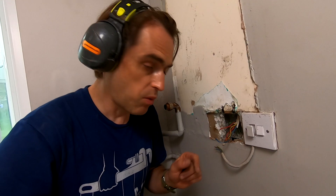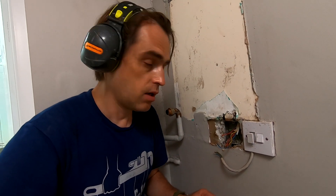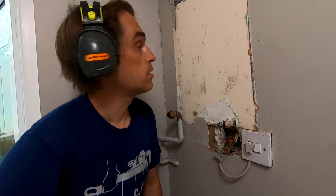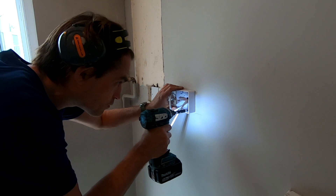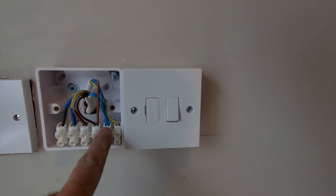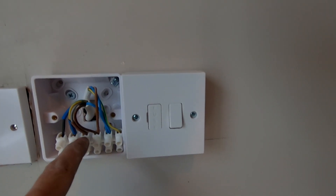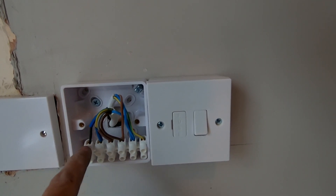I'm going to buy Worcester. I've got five wires going to the airing cupboard plus earth, so that's all I need - excellent. What's not so excellent is that both of those are where the boiler is going, so I need to see if I can move them, move the boiler, figure something out. So: earth, neutral, live - that will go to the boiler. Switched live from the boiler to zone valves to operate them as diverters. NTC and NTC going to the cylinder. That's all the wiring I need.